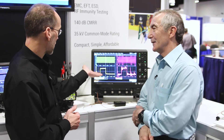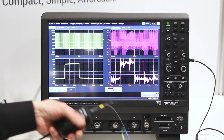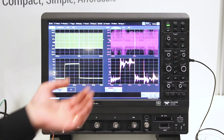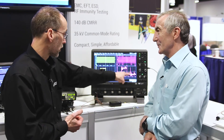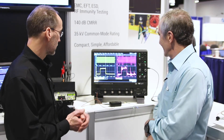You've got a couple of waveforms here — tell us what we're looking at. So the yellow waveform is measured with our HVFO, and the pink waveform on the right is the same measurement but made with a conventional high attenuation differential probe. This is what most people are used to seeing with their high voltage differential probe, which is not really great. That's an upper side gate drive. You see all the CMRR causing all this interference, and the noise and the distortion on the signal. And the HVFO is nice and clean, nice and square, like what people expect.